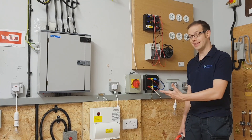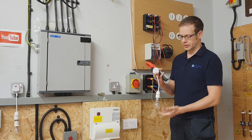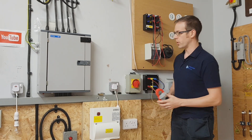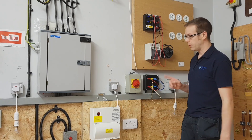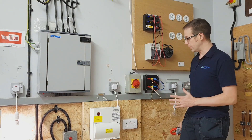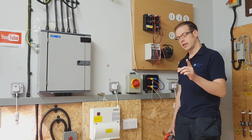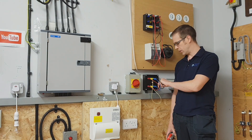So let's see how these loads — these lamps that we've got connected up — are going to behave when we connect them to a three-phase supply. You can see here that we've got a plug connected to a lamp holder with a lamp installed. All these lamps have roughly the same power rating so they're all approximately the same. We'll turn the circuit on and then turn that lamp on — that lamp is on L1. If I disconnect the L1 conductor the lamp goes off. Plug that back in. Now what do you think is going to happen if I unplug the neutral to that lamp? Well the lamp obviously goes off, so that makes perfect sense.